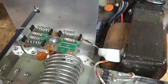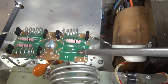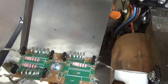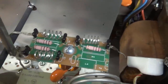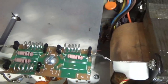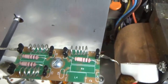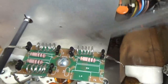It has regular incandescent bulbs right now. This board was purchased from Ameritron when they were still selling parts. The straps are really rigid — I started swapping these out when I would see this, because they can end up snapping. These ones have not snapped, but I'm going to swap them. You want these straps to be nice and flexible where they connect to the board.